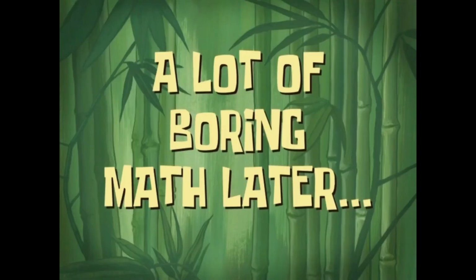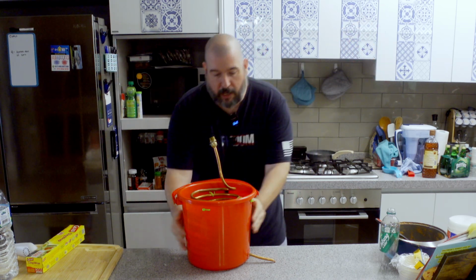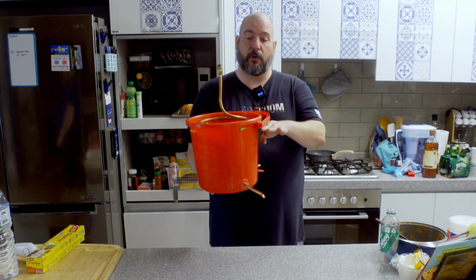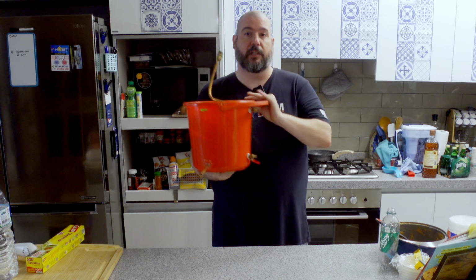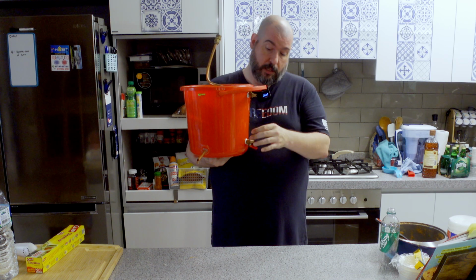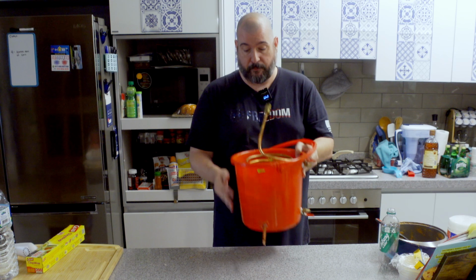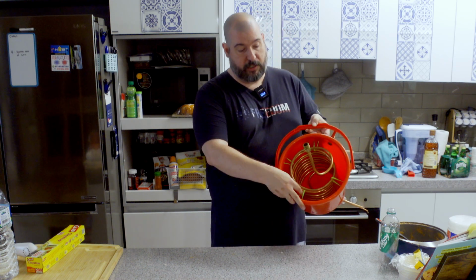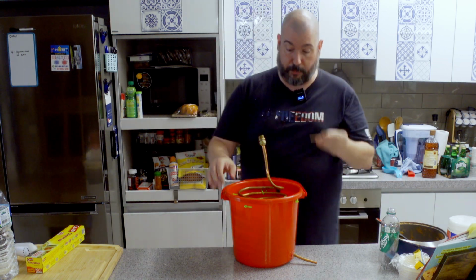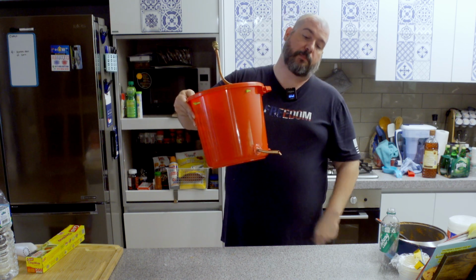A lot of boring math later. All right, everybody, it's time for the final update on this video. I've got my bucket condenser. I leak tested it, filled it up with water, and aside from the fact that I originally forgot to close the valve here, it actually holds water. Yay! So the seals around my nozzles or my barb fittings here are good. I added a couple more zip ties here to hold the bucket in place. I used a little bit of the copper tubing that I had to cut off to get it in there to make myself a little downspout.